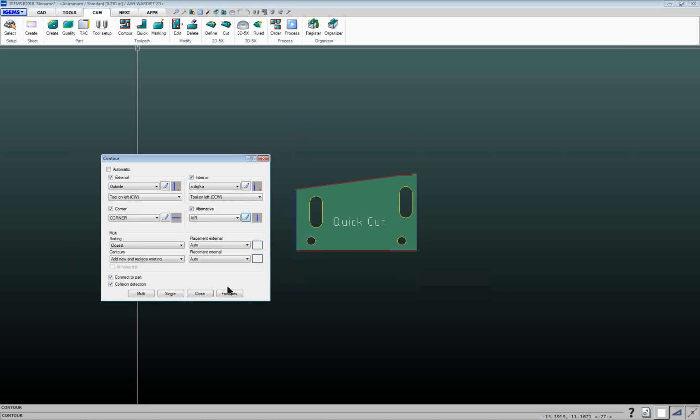Then one neat thing down here is you can save lead favorites. So you can set up different lead types for, say, thin material versus thick material. If you've got material that you drill, or you do circular low pressure piercing, or water only, you can set up different lead types. So let me go ahead and delete one of these. If this is now what I want to use as my default lead type for, call it thin metal or whatever, just click on this and click on save, and it prompts me for a name, however you want to define it. Aluminum, always fun to do here. Let's see, aluminum. All right. Then if you want to change, you just click on that, and you can change to different lead types. So that's quite nice if you are working with different materials and thicknesses and things like that.